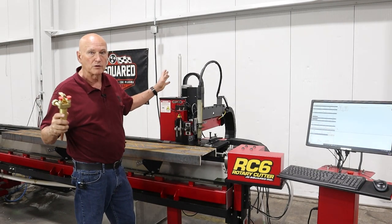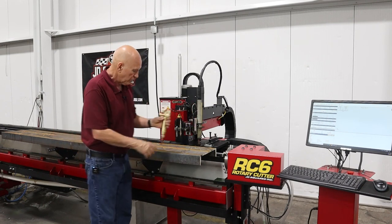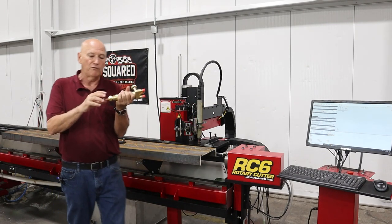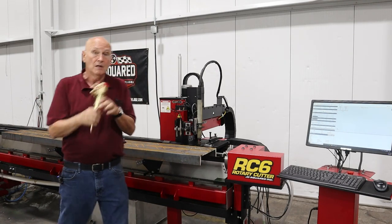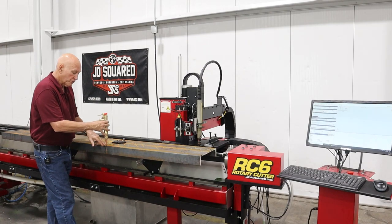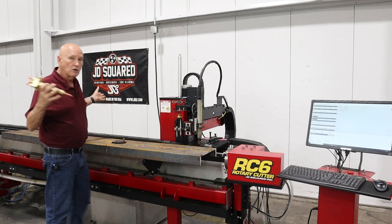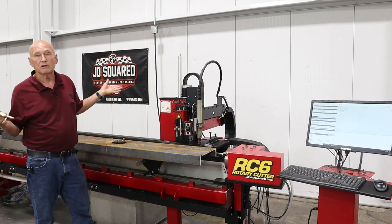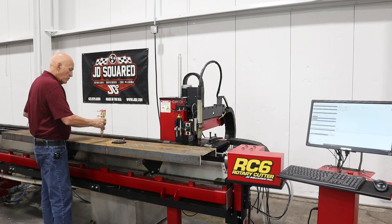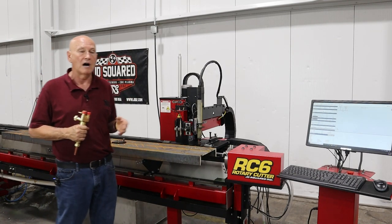With this torch, I'm going to be able to start on the edge, and as long as I use a sufficiently large nozzle that'll cut through three inches, I'm going to be able to strike it and cut through the flange. It'll transition into the thinner section of the channel — no big deal if we've got a slightly bigger tip than we need. We go ahead, we cut — bam! Casco's got their entire step cut in one operation.